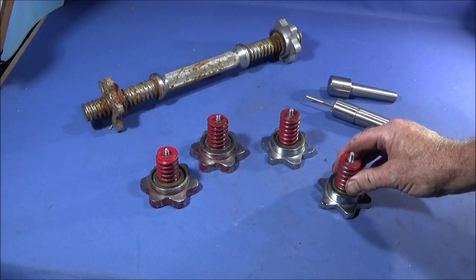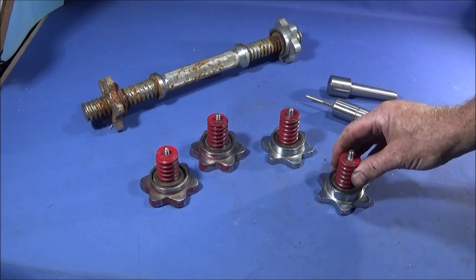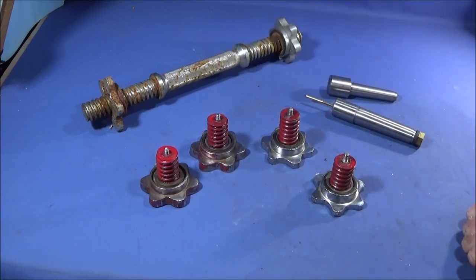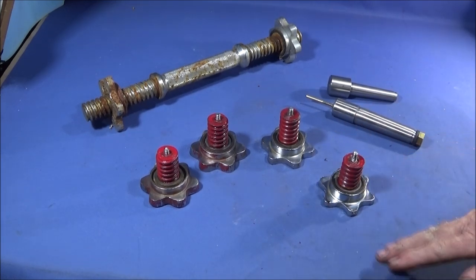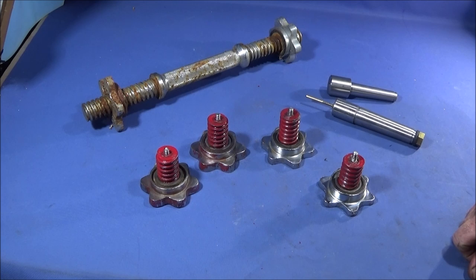So they make brilliant adjustable legs, and one of the fortunate things that happened when I came to put these on the base rim of the wood burning stove, or the beer barrel, was that there were already four 5mm holes. So all I had to do was tap them for a 6mm thread for these to go in. It is actually rare for things to work out like that in engineering. Normally things go wrong or you have to work out different problems, but there were four holes on the base of the beer barrel, and they were all equally spaced, so they worked out excellent for this project.